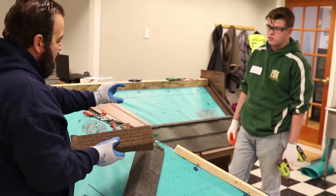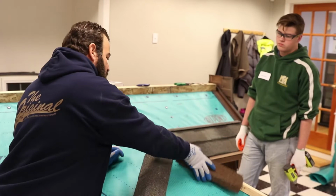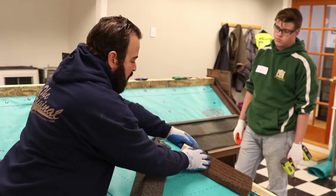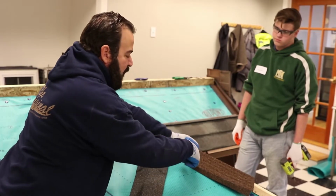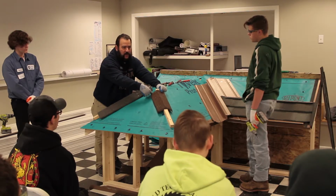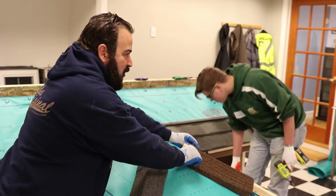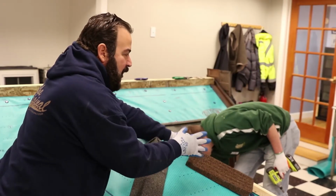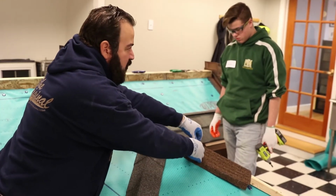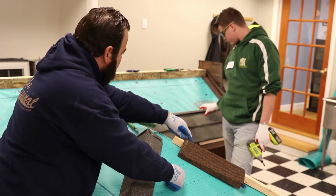With the shake, because it's a thicker profile and we've got a thicker leg that sits on here, when we put this down on the roof, there's no way to get good solid beef because you're looking for that contact. If you just had a floating screw in there, you know, wind vibration and things starts to move all that, and over time it loosens up the attachment that you get between the screw head and the piece and starts to move. So you want to make sure you've got good solid beef. So when we get those screws in there, you get more of a compression and a tight hold, and that's where you're going to keep your seal.